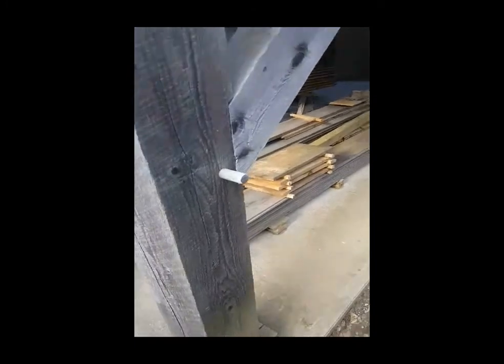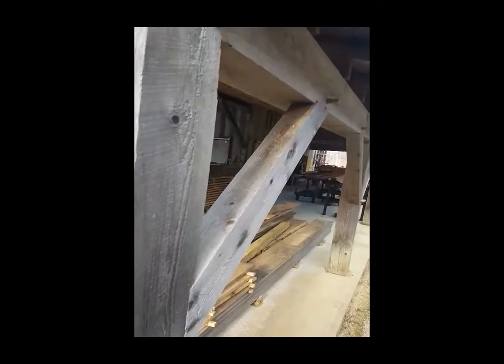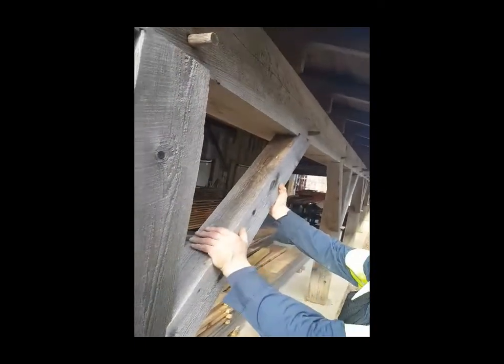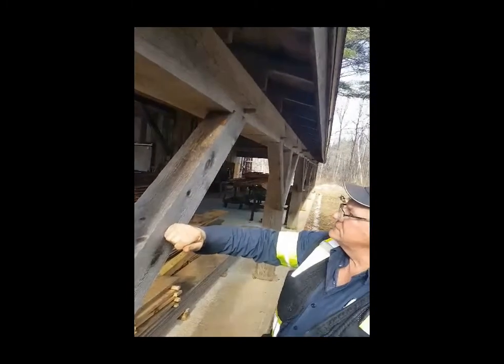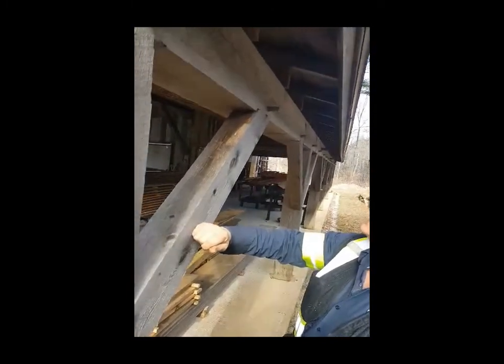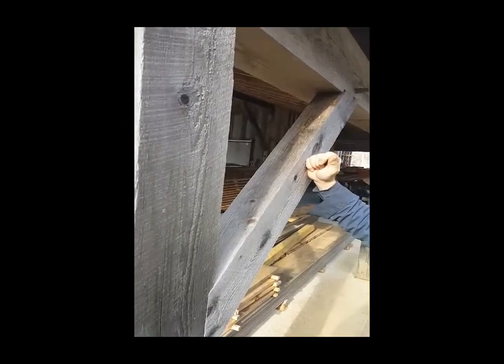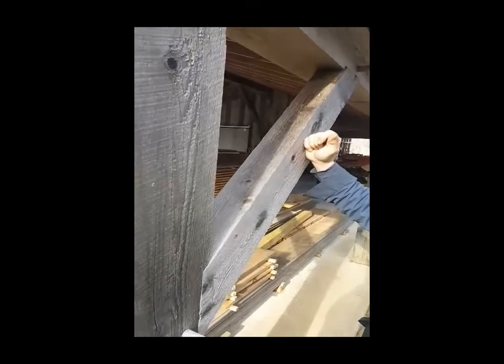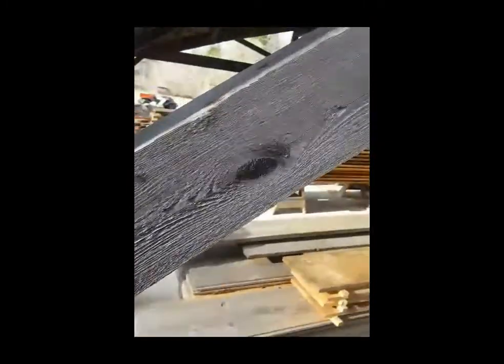I am here with Mike. This is Jim Rogers, and we are inspecting his frame. Down this side, as we can see, 56 feet long — this plate for his saw barn. It has 8x8 posts and 4x6 braces, 3-foot layout, 50 and 15/16 inches. These joints were cut 12 years ago, and the brace is solid. That is number 1.